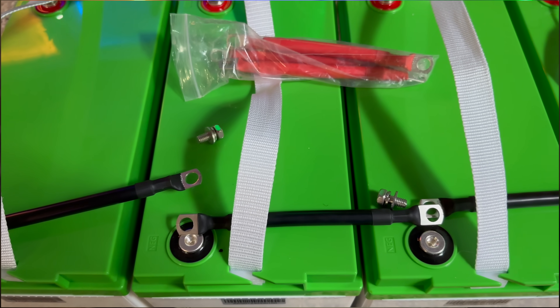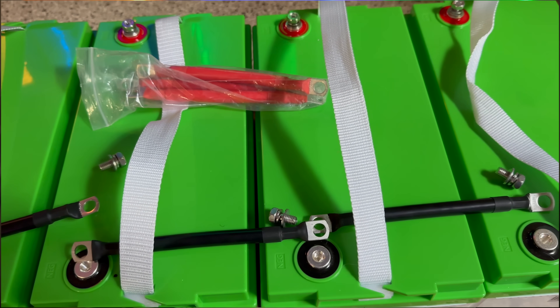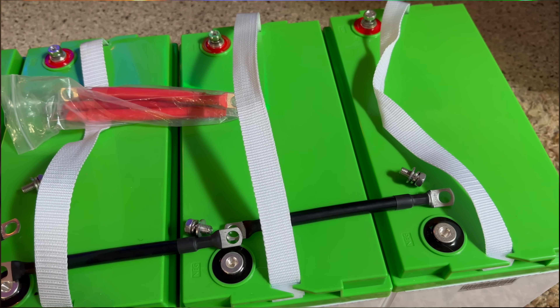My first step was to cable the batteries together in parallel. Before doing that, I also bought a new charger capable of properly handling the charging of lithium iron phosphate batteries. I then charged each one fully and checked the voltages between each one — they were all within a couple hundredths of a volt, which is important. Why? Well, imagine worst case: you had one fully charged battery and one depleted battery and then you hooked them together. What you'd have is a direct hardwired connection where the charged battery was doing everything in its power to send current into the depleted battery. That can overload the interconnect cables and is generally a bad idea. So you want to make sure they're all in the same state of charge when you connect them together.